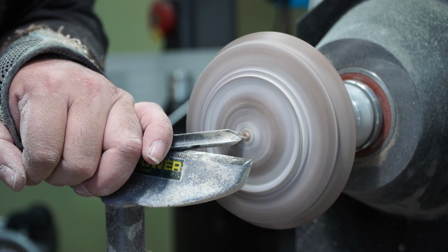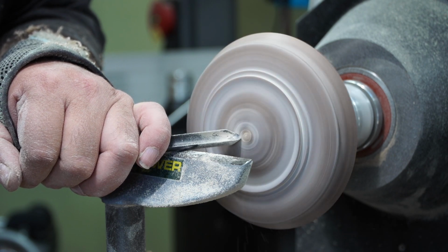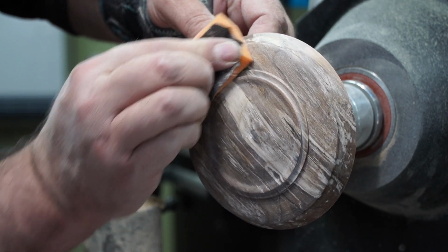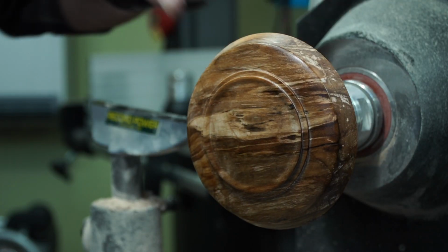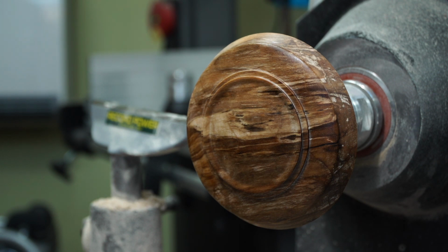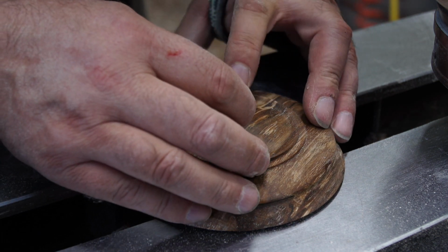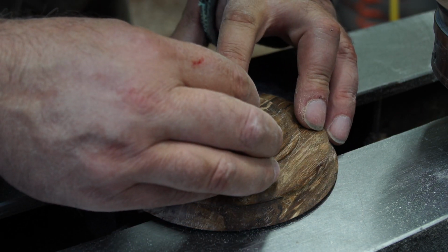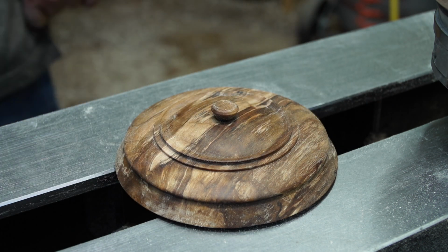And yeah, it took me about half an hour to find a stupid piece later because I actually decided that I was going to glue it back on, but we'll get to that. I'm doing a bit of detail hand sanding, and this is not oil, this is actually denatured alcohol, because I don't want to put oil, otherwise my glue won't work. And here I'm kind of practicing this. There's only one shot. I'm using CA glue, so once it goes on, I either put it in the center or off the center, who knows.